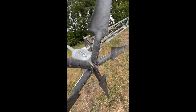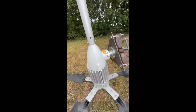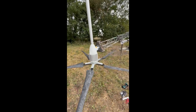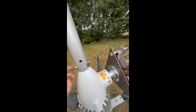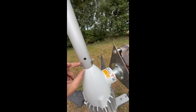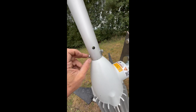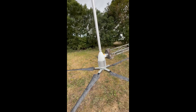We've put the 27mm retaining bolt in to hold the end plate to the turbine. One thing I've had to change from the Easter Breeze design — the tail fin is in the right orientation to the turbine, but unfortunately Easter Breeze put the bolts here and the shaft bolt underneath is much closer, which isn't ideal. You'd have preferred the internal shaft position to be higher up, but it should be fine — it's pretty secure and I don't think that'll come off. So there it is, the whole thing installed.